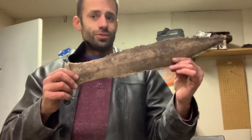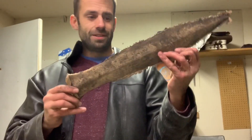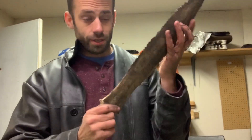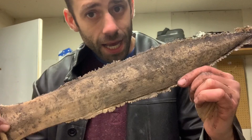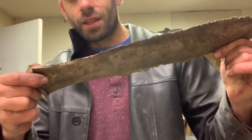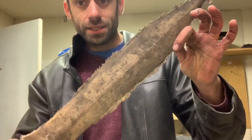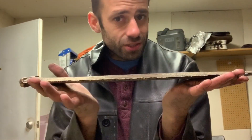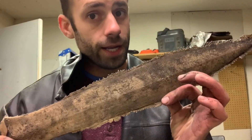Story of my life — I didn't have enough bronze. So the good things about this: where I actually had enough material for the cast, it looks pretty good. The color of the bronze is amazing. I ended up putting five pounds in there. This blade is just way too thick. I need to thin it down. Let's try it again.